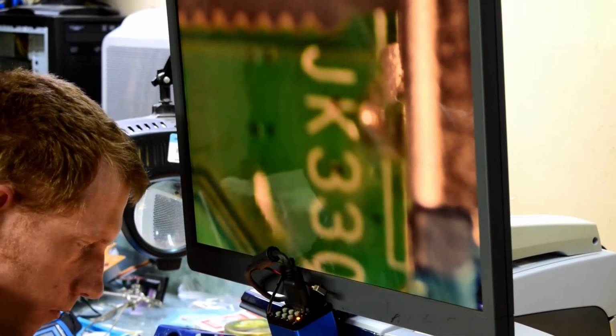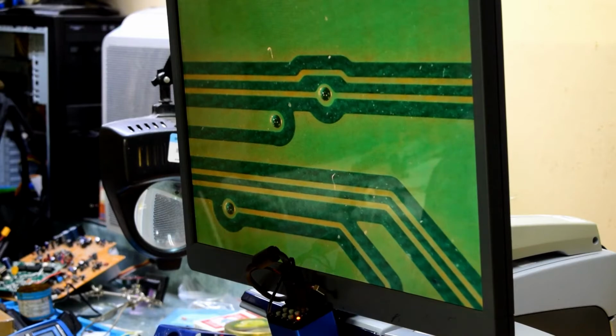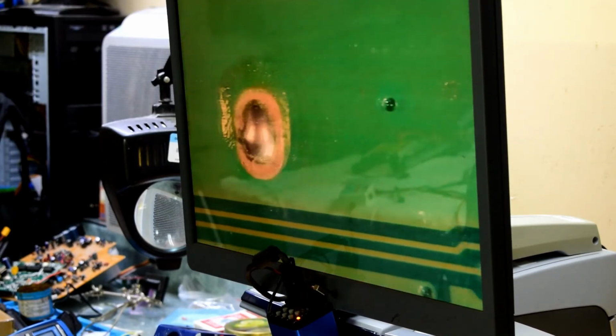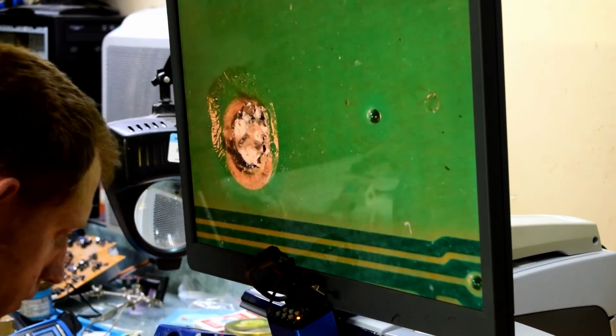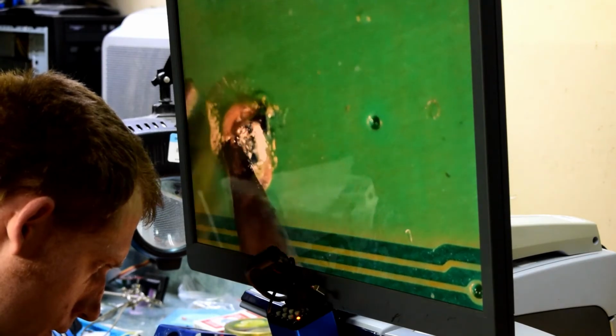Just making sure that in this case you can increase the temperature of your soldering iron, because you want the solder to flow through the via of this leg. And also on the bottom you can see the vias where this connects to the HDMI port, just heating that up so that it connects to the leg again.